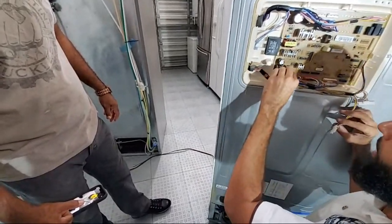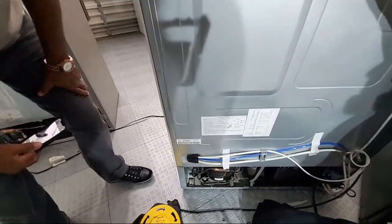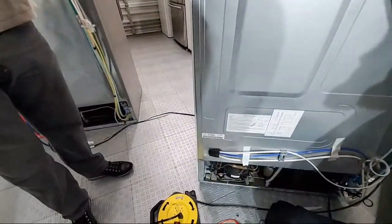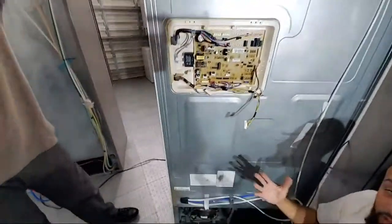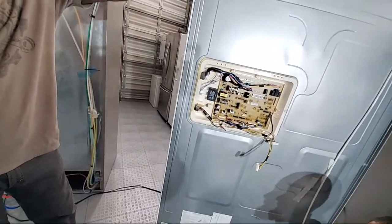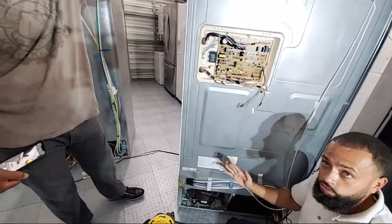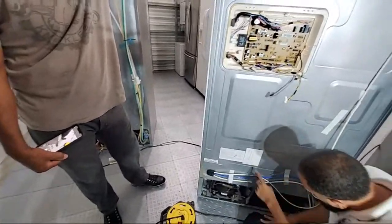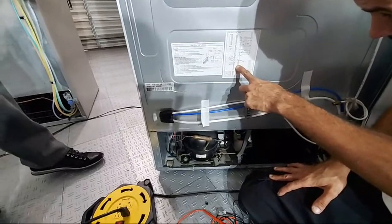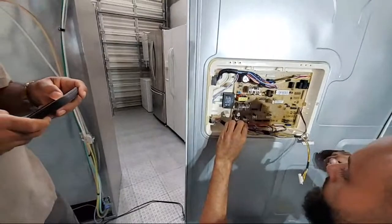Look, pin two right here. And if you look carefully, what does it say on the C fan? Condenser fan, yeah. Okay. So now we know that's our plus, but we have to have a reference point. Our neutral, our return. Our plus, our minus, our L1, our neutral. We always have to have 2 points that we're measuring. So now we have to find our ground or neutral, which would be green. Pin 10, green. Green or gray? Gray.